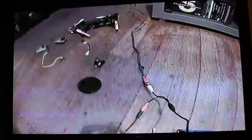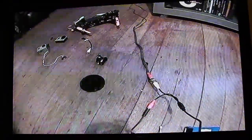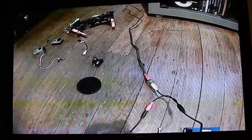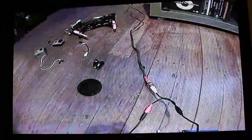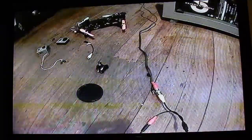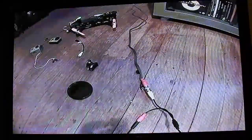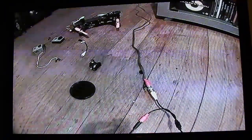Now if you've flown for a while, you know that there is latency on them, and depending on how good you are, it is either a problem or not. I flew for a long time with the video out from the HERO2 without any problem whatsoever, and it was only when I got a little bit better and started using the dedicated board cameras that I noticed there was quite a lot of latency when I went back to trying to use a GoPro output. By then I'd stopped using the HERO2 and was using the HERO3, and it seemed to me that there was a huge amount of latency on the FPV output from that.